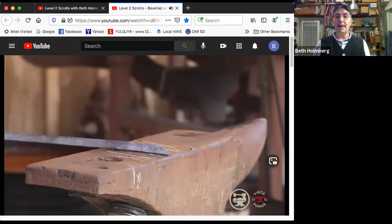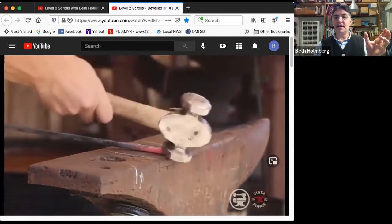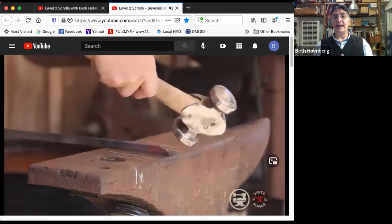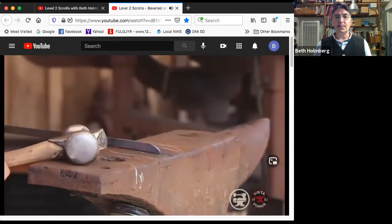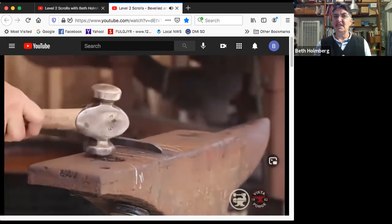So next heat, I'm going to put a little teeny taper right on the front of the bar. Just, again, really short, 3/8 of an inch on the tip, both sides, steep angle to keep it short. And of course, you have to fix the profile after you're done with it. It always happens. Fix the profile. This guy was not staying centered, so I just chased it until I got it centered.